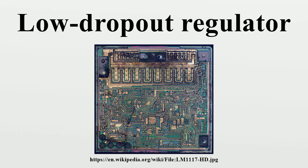It is important to keep thermal considerations in mind when using a low dropout linear regulator. Having high current or a wide differential between input and output voltage could lead to large power dissipation. Additionally, efficiency will suffer as the differential widens. Depending on the package, excessive power dissipation could damage the LDO or cause it to go into thermal shutdown.